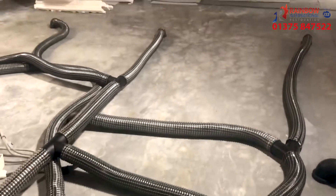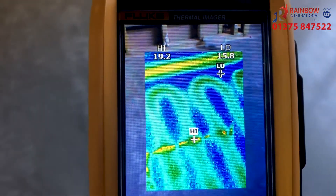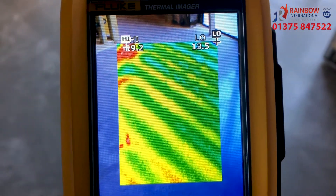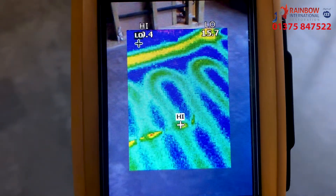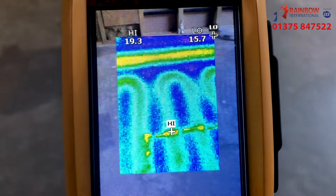In order to drill all the holes needed in the concrete slab, we use a thermal imaging camera. Here you can see it has highlighted the underfloor heating. The underfloor heating will not dry this concrete slab as it is trapped between the insulation and the DPC. By drilling the holes it allows us to release the moisture, and using the forced air system dramatically decreases the drying times.